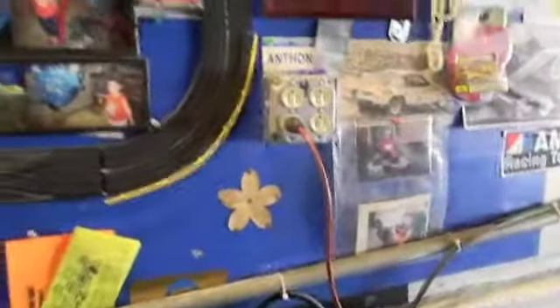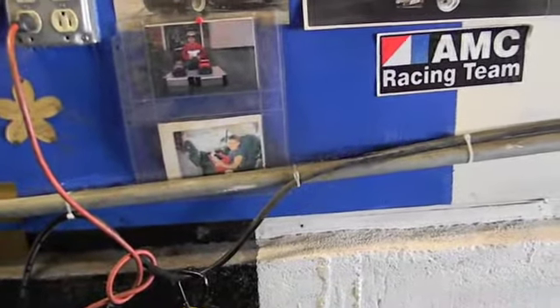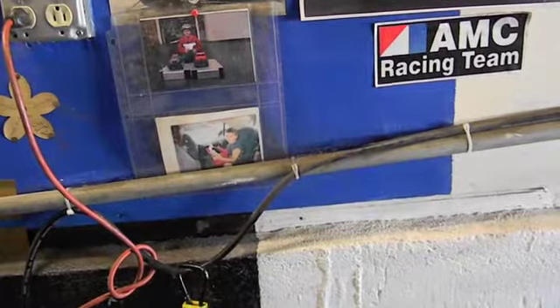Reuben, this video is for you. My airlines are right here. Reuben was showing that he did his copper setup up the wall, which acts as a radiator — or a condenser is another way to put it. Basically he has the compressor coming out and plumbed right into it. He has some downspouts on it like I have downspouts. Then he put his receiver dryer after it because he said his receiver dryer was getting way too much water.